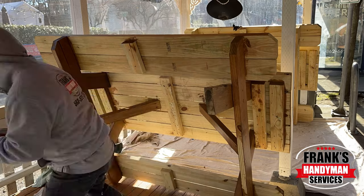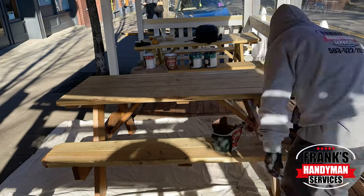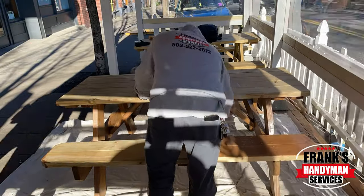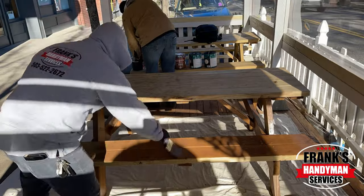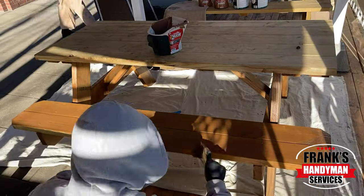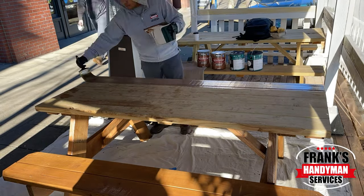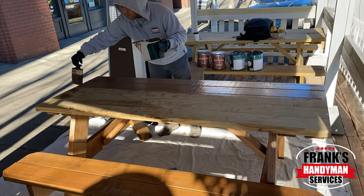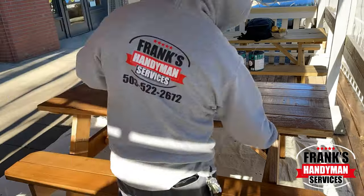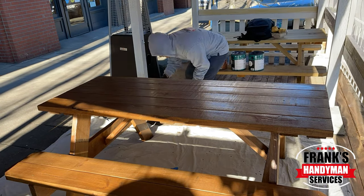It definitely transformed this outdoor dining area. Once you paint the bottom part, you can flip it over and I started painting the bench on top, making sure to get all of the sides and the top. When I first put the stain on, I make sure to spread it evenly in long strokes, and at the very end I do super long strokes from one end all the way to the other. I try not to stop in between or anywhere in the middle since that's going to leave marks from the brush. So once you apply and spread it out, at the very end you just want to give it a really long stroke from one end to the other without stopping, and that's going to give you the most beautiful and professional results.